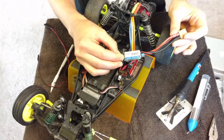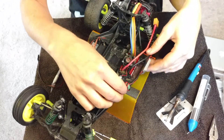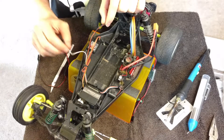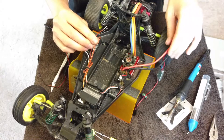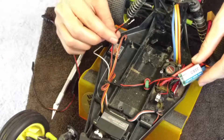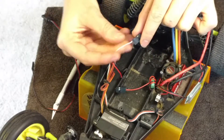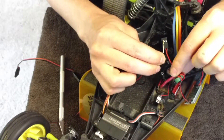Now that we've soldered our BEC into our battery connector, we're going to want to bypass our existing BEC inside the ESC. Let's trace these wires back into our receiver — I've already unplugged some of them. Disregard the signal wire for now; we're going to want to remove these two wires coming from our existing BEC and reroute those with our external one. We can put those aside in case you want to reuse them in the future — I'll just heat shrink them to the side to keep them out of the way. Then we're going to unclip our signal wire, the white one, and reroute it into our external BEC clip.